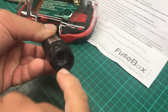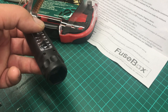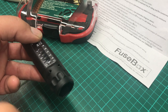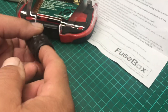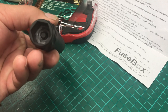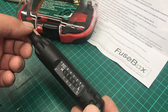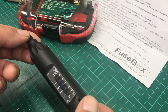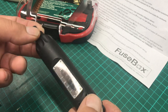So a T-handle with a hex on there would be a nice addition. If I came across electrical screws needing more than four Newton meters — which was about my limit — I might consider 3D printing a handle. You could machine one in metal, but metal would be too strong and you risk damaging the tool. It is strange they put that hex in there though — it does look like they want you to use it. Anyway, I've used it and it's fine — a heck of a click when it reaches torque. If you're an electrician you might not want to use this every day.